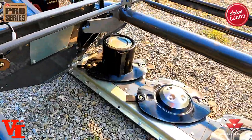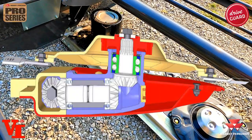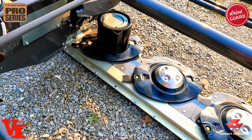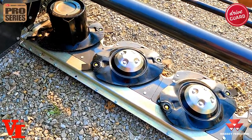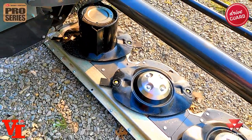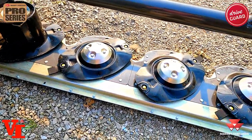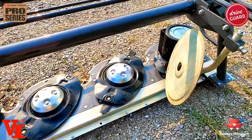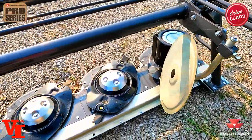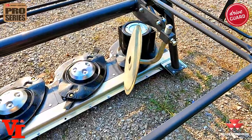Look at this compact angle design. The shaft comes through, drives a gear that drives forward underneath this turtle head. One of the features allowed by the shaft design is that power is transmitted to each unit equally — equal distribution of power to each cutter head disc, whether it's a five-disc, six-disc as featured here, or the big seven-disc unit. Load and wear is lower, so we're going to have less wear and tear on our cutter bar.